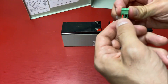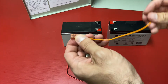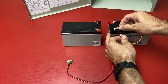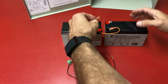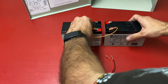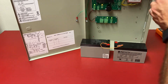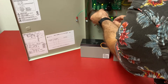Now those are going to be ready to plug right into the power supply after we're done wiring up our batteries. Let's grab our jumper so we can wire these two batteries in series. I start with the terminals furthest away from the power supply board — closest to me — put one on the black side of the second battery. Make sure that the clip is facing up so that it locks into the battery terminal. I'll fish these wires behind the power supply output board so there are fewer wires getting in the way.